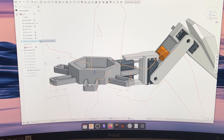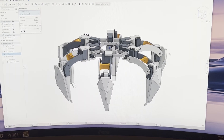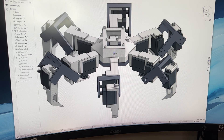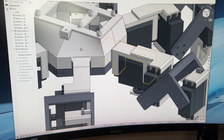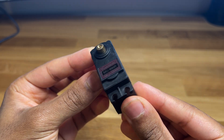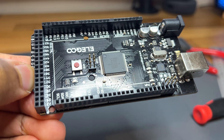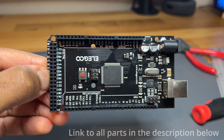So the first objective is to figure out a design for the robot. After testing out a few different ideas, this is what I came up with. Each leg has three joints connected together using some 3D printed pieces, which are then connected to the base of the robot. Since there are six legs, I'm going to need 18 motors in total. To keep the cost down, I'm using cheap servos found online. And to control the hexapod, I'm using an Arduino Mega — with 54 digital pins we can control the 18 servos with plenty of room spare.